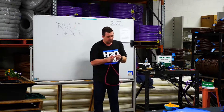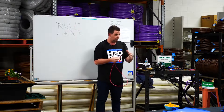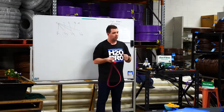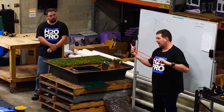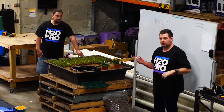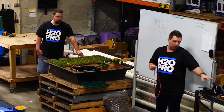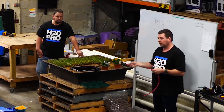This is a 0.5mm² cable I'm holding in my hand. The cable you'd probably be using on larger sites would be 1mm² or 1.5mm². You can run half-mil cable out to about 120 metres max, and then you're going to start getting voltage drop, which could affect the coil opening and closing. The next size up from half-mil is one mil, then 1.5 mil.